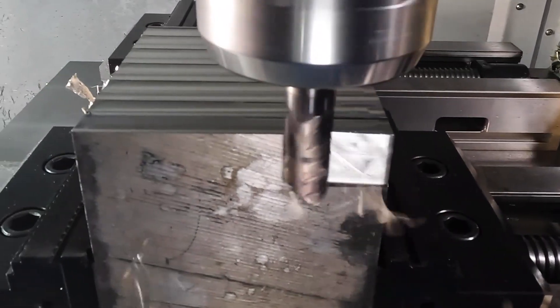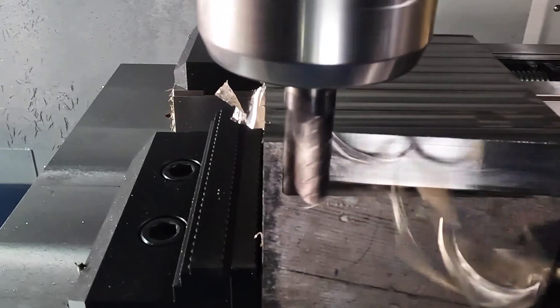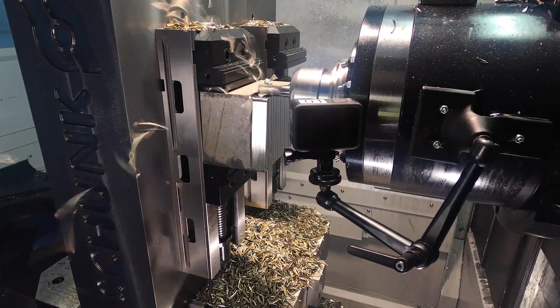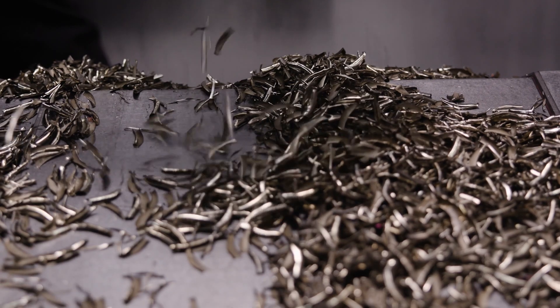Another recent challenge was on a large 13-8 part that needed to have 2,000 cubic inches of material removed from each forging, and we had 18 of these to do. I programmed everything with a three-quarter roughing end mill, and on some forgings the tool would last for five minutes, sometimes it would last for three hours. In the end, I had to switch to using a high-feed mill just due to the inconsistency in tool life that I was getting.